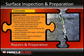Expansion joints: For a completely smooth surface, expansion joints should be filled before sanding concrete surfaces. Filling expansion joints with flexible joint sealer will allow movement during freezing and warming conditions. Remove loose concrete pieces within joints and clean the surface with a wire brush. Pour the flexible joint sealer into expansion joints and let the joint sealer fill above the concrete surface. Smooth flexible joint sealer with a putty knife or trowel in order to level the surface area. Let sealer dry 24 hours before sanding or etching concrete. Note, it is quite common that sanding of excess joint sealer will be needed for a smooth epoxy finish.